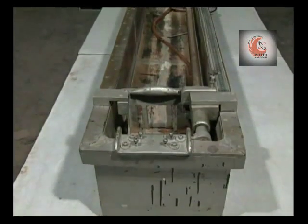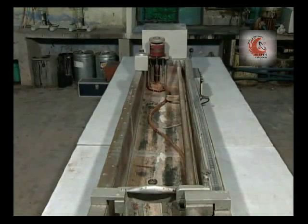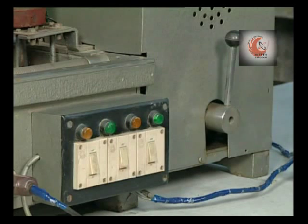For this, we need a ductility apparatus. This consists of a rectangular tank that is provided with a copper or steel liner sheet. It has a built-in heater for use in winters, a pump to circulate the water for maintaining uniform temperature. The machine has a clutch to select appropriate speed during testing.